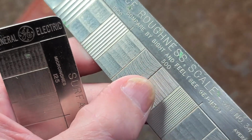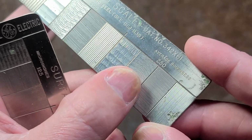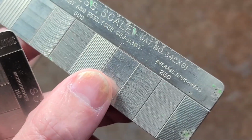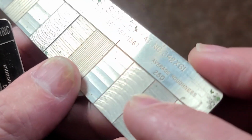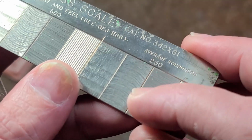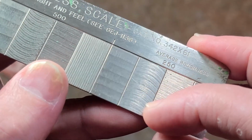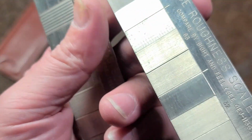This would be kind of akin to a saw cut here. And then we go down to 0.25 thousandths of an inch. And that might be called 2.5 10/1000ths of an inch if you want to do it that way. This kind of finish here, that's 2.5 10/1000ths. This type of finish you might get from an abrasive cutoff saw, cutoff wheels, and of course sanding. And that's why they give you a variety of these different textures, like this circular texture, which is indicative of a grinding operation.